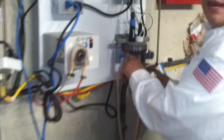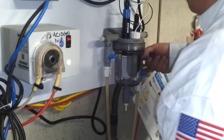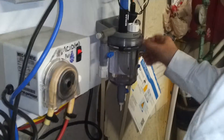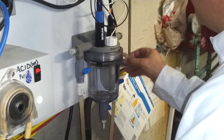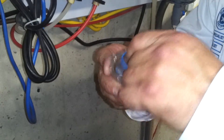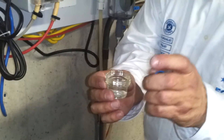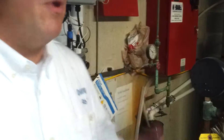We turn off the inlet and the outlet to the sample jar, and then what you can do is unscrew this cap. A little water will come out. Inside is an inline strainer, just a fine mesh screen. All you do is take it over to a sink, dump it out, and rinse it out. You can see fine particulates that get into that screen or into the reservoir that the screen is keeping out. The reason this is in place is to keep these particulates from getting into the sample jar and throwing off any readings.